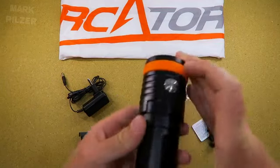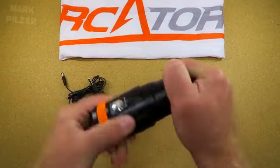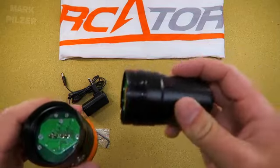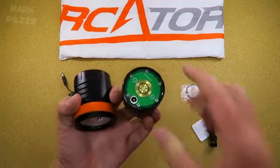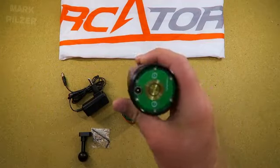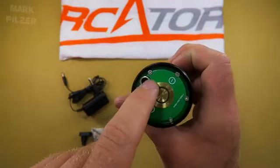Let's focus on the charger. If you open the light, you can see it's very easy to open — it has a dual O-ring seal, very cleanly cut thread, and spring-loaded plus and minus contacts. The battery pack is a 3S, so 12.6 volts when fully charged, with a direct charging plug built in.